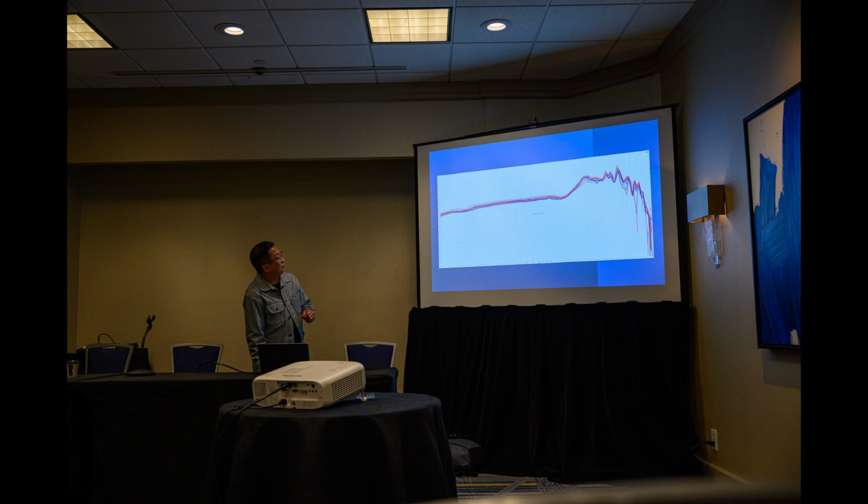With a driver resonance, yes, but for a sealed IEM, like the W60 or the Etymotic, if you normalize at around 1K and look down, you really shouldn't see much of a shift in the bass. But I think there are two other things that we need to look at. And if I'm wrong, I'm happy to admit it.